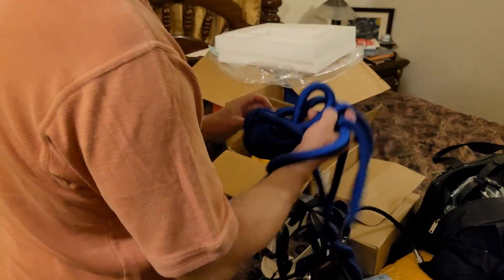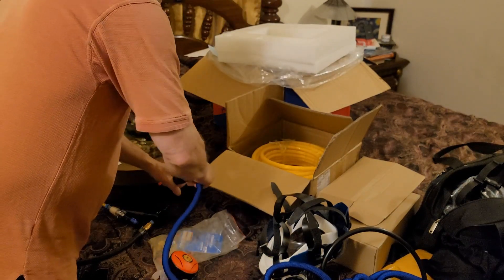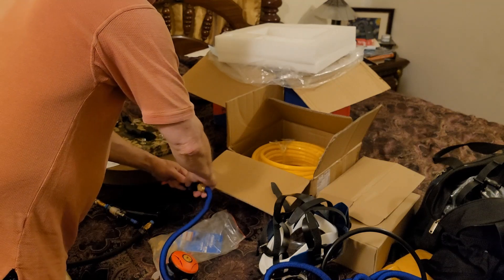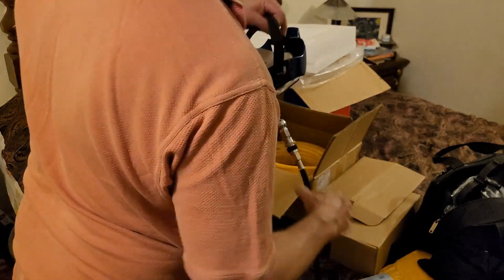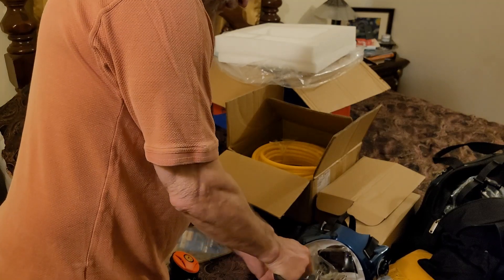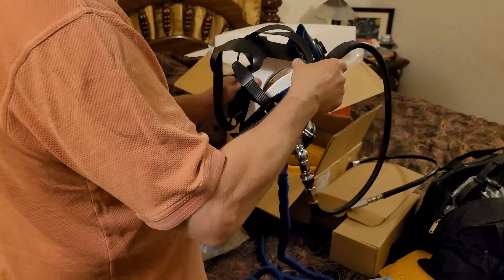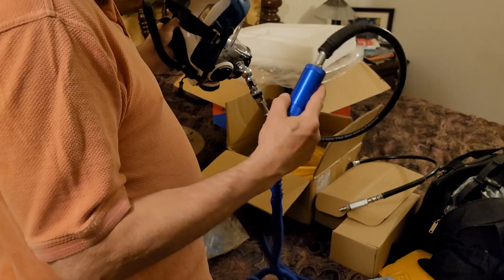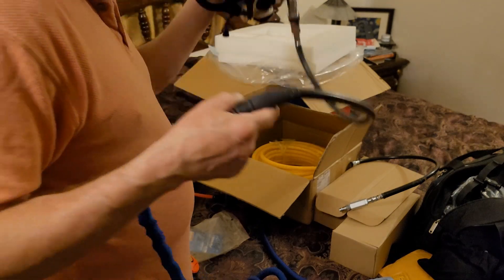We now have — grab your end, the orange hook — plug that in there, make sure you turn that locking device. We'll check that one comes off. This one here also has a locking device — spin that forward and lock it. Now we have 30 feet of air connected to my mask. So there's a quick hookup of my mask to the system.